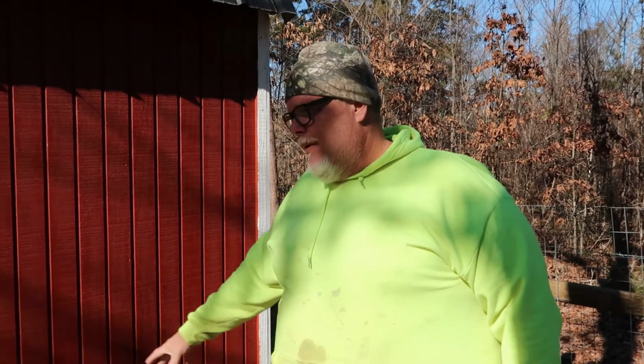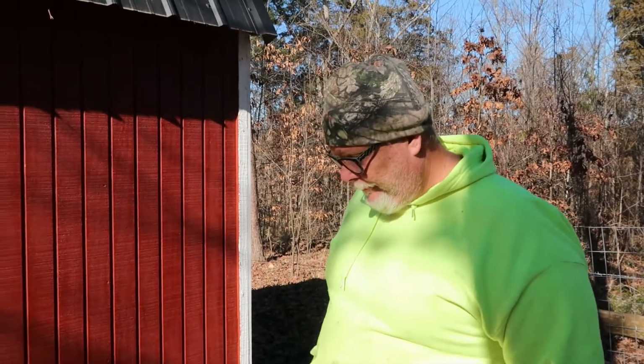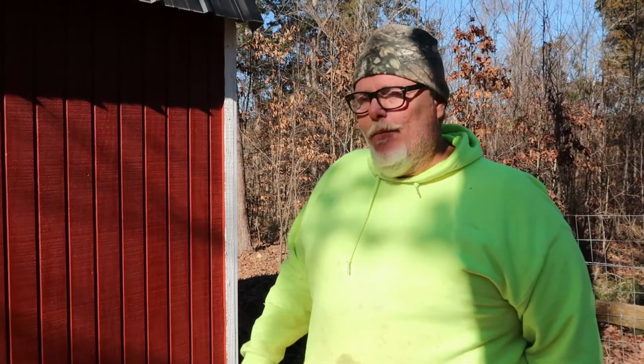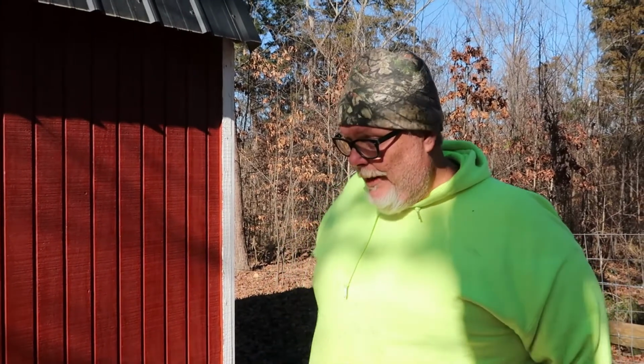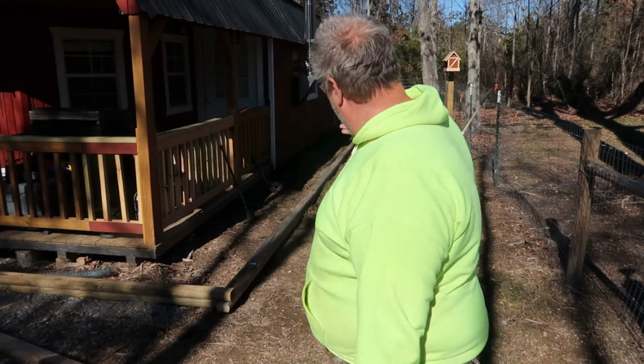And then we'll measure off from the house and make sure it's 3 foot from the outside all the way down the side of the house. That gives us, like I said, you don't want anything pushed up tight against the house. So you want a gap behind the house, front, whatever you want it to be. The chert that we're bringing in will be up to the top of the first row. So that's where the chert will stop. And then the second row will be what you get to see visually. So let's get through and get this stuff done. All right, guys, so we got our runners put down for that.